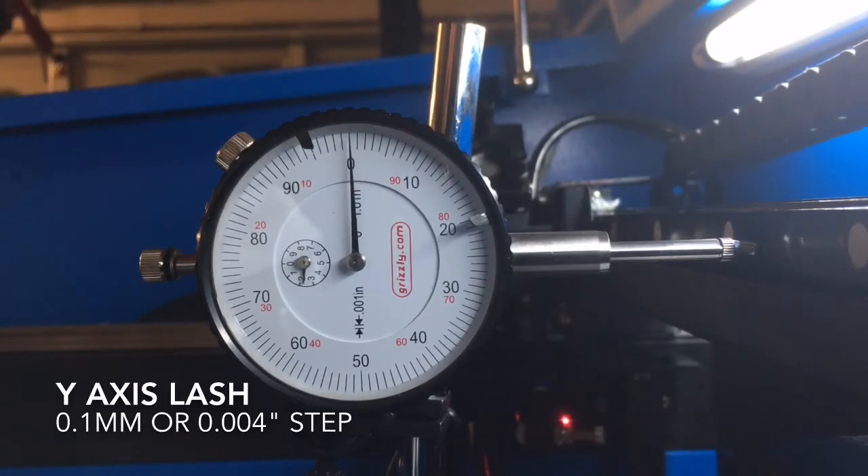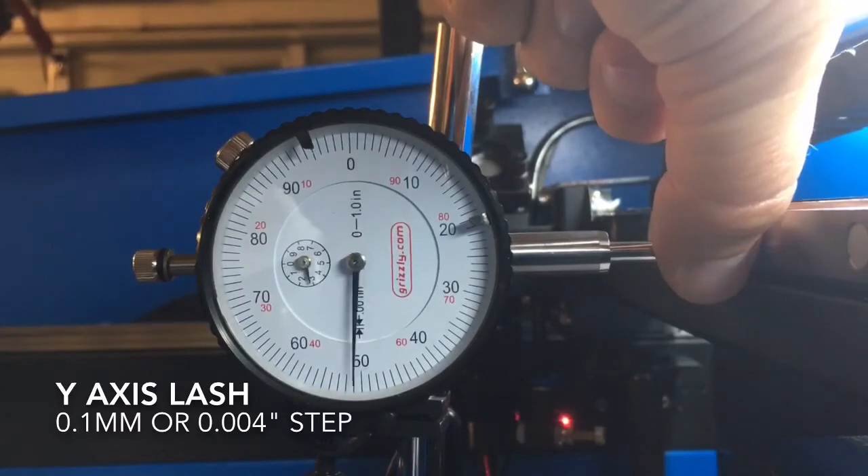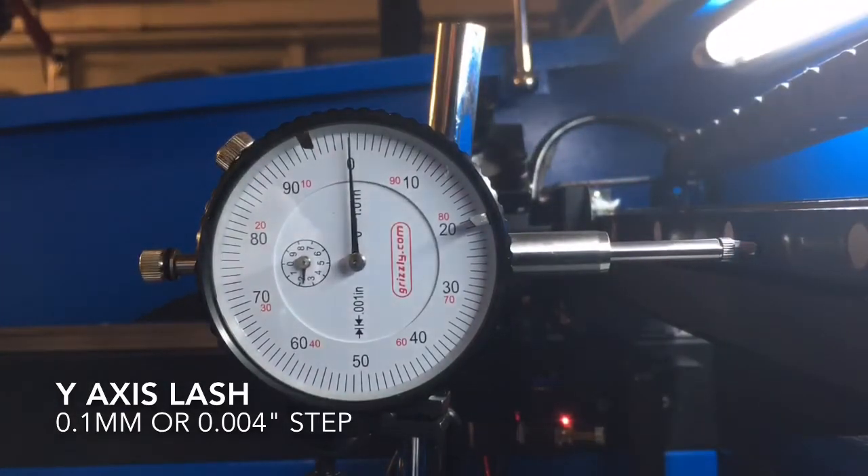That's what kind of worked out best. So if we move 10 steps, we should be able to move about 39 thousandths of an inch. I'm going to press the up arrow 10 times, which will move the gauge counterclockwise towards ideally 61 thousandths. I'm just going to reach in and press the dial gauge so you can see that the fixture returns to zero even though force is applied — this verifies that the fixturing is not flimsy.